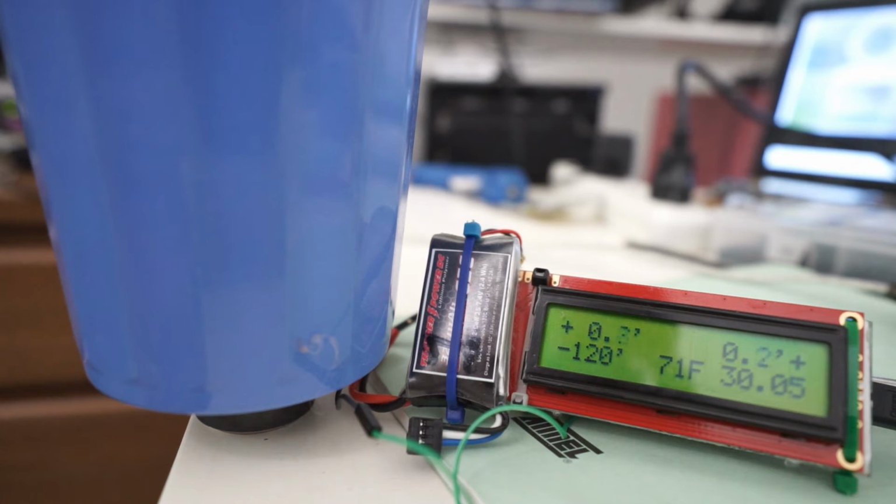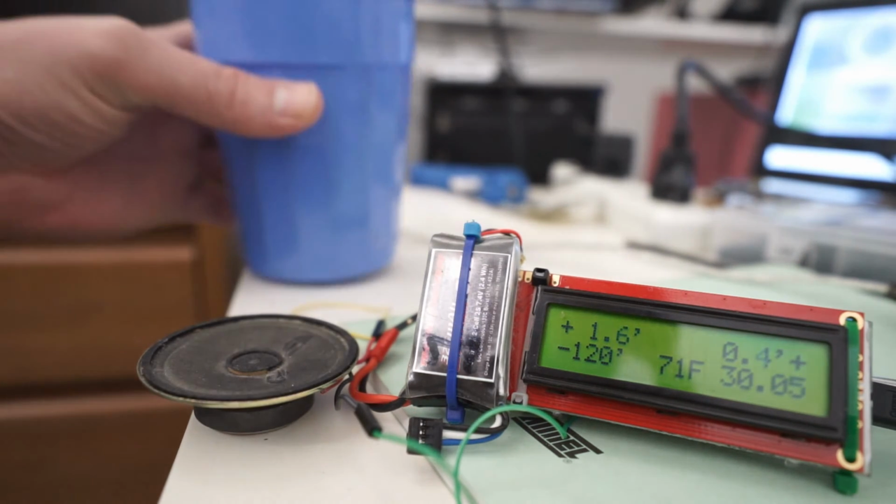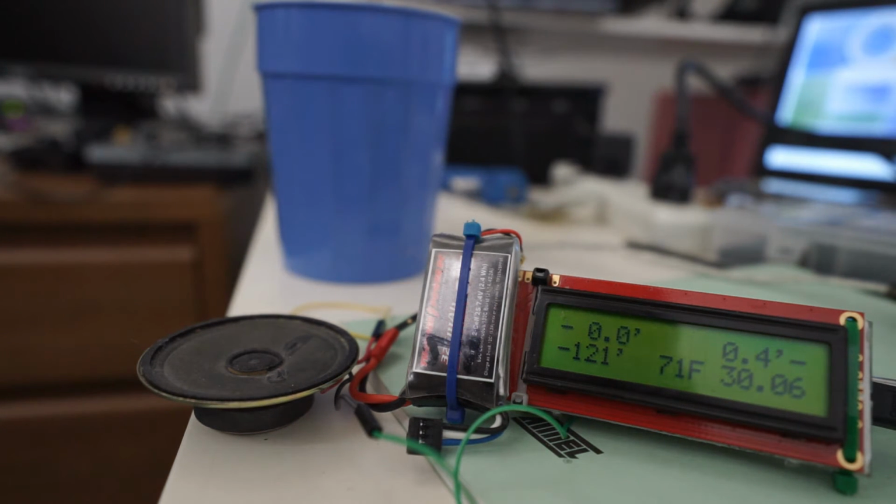And I think the reason it's doing that is because I'm using the Arduino library to drive a pin on and off, and it uses the PWM timer for that. The PWM timer is hardware, so it seems like it could just run asynchronously without being interfered with. But through the Arduino library, because I'm not using the PWM pin, I'm using one of the other pins, there has to be an interrupt for when the timer reaches the top of the value. There has to be an interrupt where it calls a little subroutine that just turns that pin on and off, and it doesn't sound like a lot, but it actually has to take some CPU to do that.